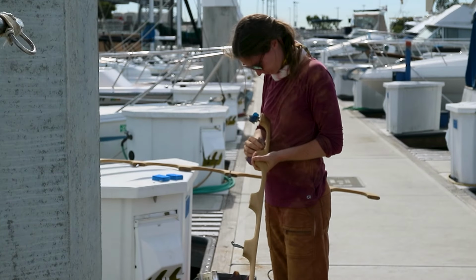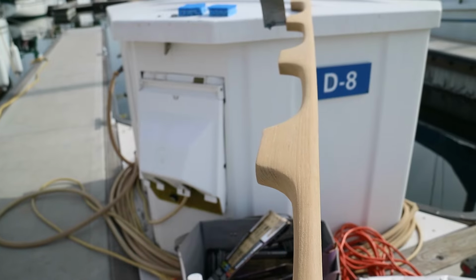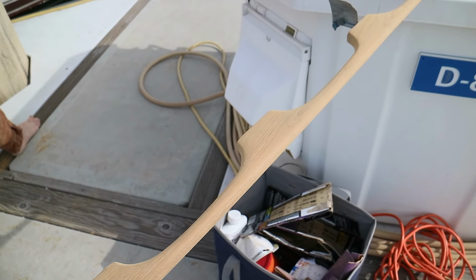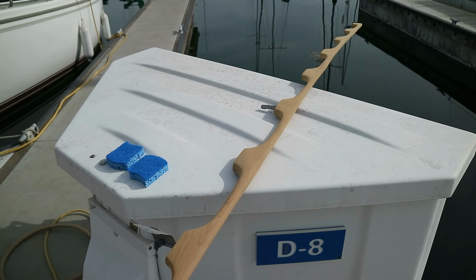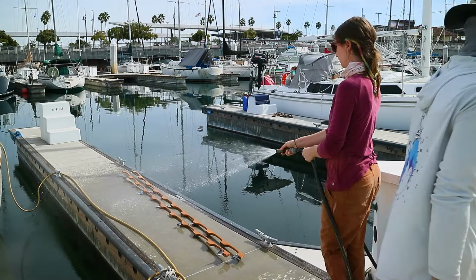The next day, we started prepping the teak for the oiling and sealing process. We first touched up some certain spots on the wood that we missed with 220 grit paper. We also made sure to sand off all the old silicone that was stuck to the bottom of the grab rails. After we finally completed our sanding, we rinsed all the dust off the rails.